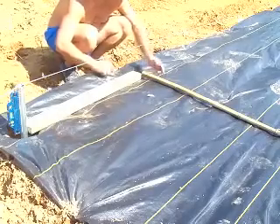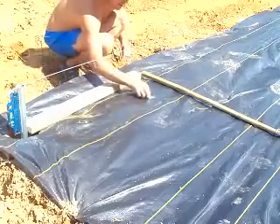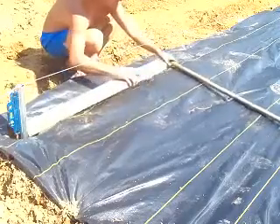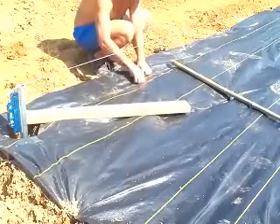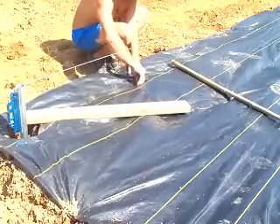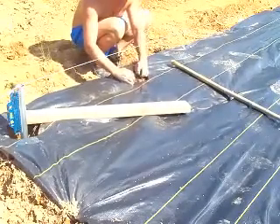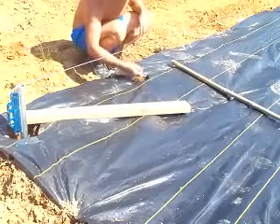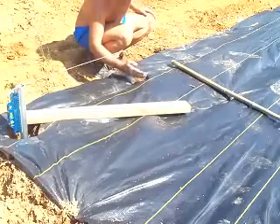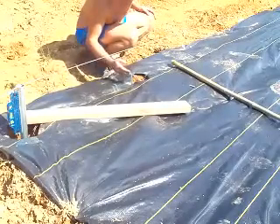So that means 12 feet long this way on this jig and 40 inches on this jig. Here I have a razor blade and I will put a hole in it right there — this is the crosshair of a post hole. Take your post hole digger and dig the dirt out about 10 inches, then put a post in and concrete it in. That is how you jig the post to make sure you have every post exactly the same — 12 feet that way and 40 inches this way.